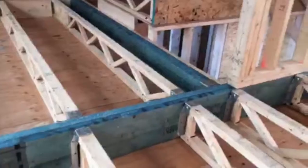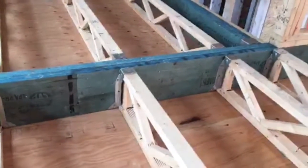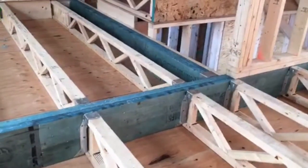This sort of layout practice is very important to do with intention at an early stage, but it even has to be considered much earlier — when you're designing the project you have to leave a place for all of these vents, especially when you have very open and modern designs like our main floor, because there aren't as many walls to bring ducts down through. With our split-level design, big spans, and thin floors there's also a lot of structure visible in the ceiling. You can't cut holes through LVLs structurally, so with flush beams you can't run a ventilation duct through them — you'd have to come under with a bulkhead, which would detract from the design.